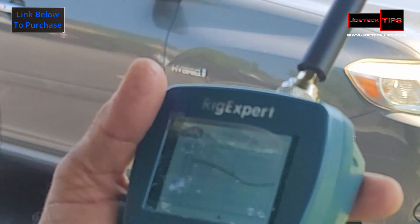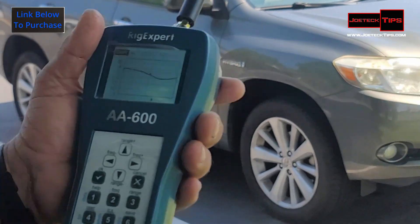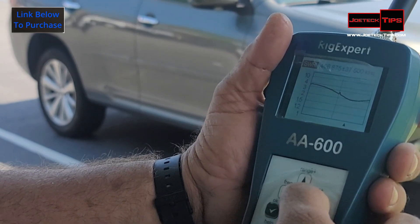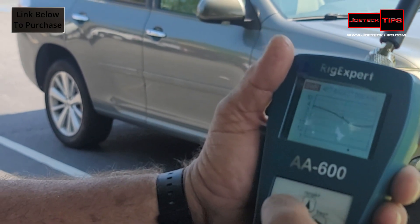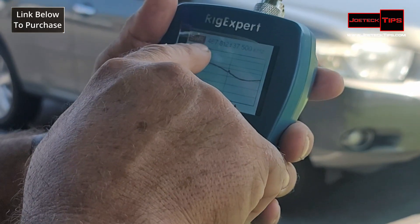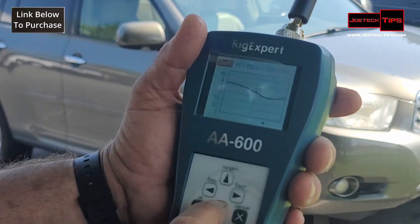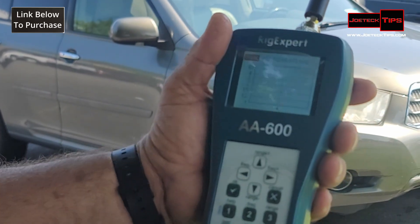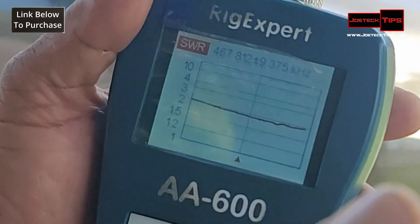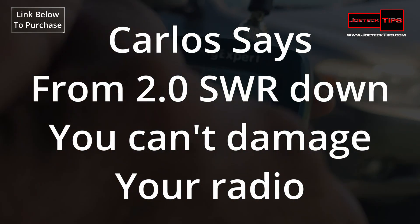Like 470? Maybe below. Let's go to the input of GMRS, which is 467.700. Well, the bottom is around there. Then you should do smack in the middle — do 467. How about 475? Well, my machine found on the steps 467.812. That's good enough. Let's check the center frequency. Let's reduce the span to 9 kHz up and down. 467.812 is on the edge of GMRS — look. It's below 2.0. So this antenna is totally usable for UHF. From 2.0 SWR down, it's usable — the radio would not get damaged.